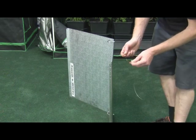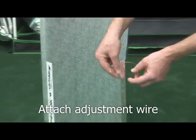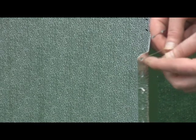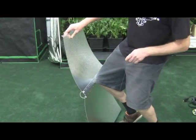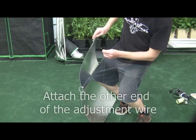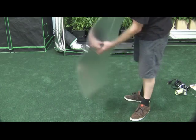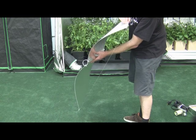To begin adjusting the wing, you put your adjustment wire in through the underside, and then back in through maybe the second hole, or one of the holes closer to the end of the wing, so that when you make your first adjustment it's not too narrow — you're not stressing the material. I find the best way is to put one edge on the carpet or the floor, put your knee in the center of the wing, bend it around gently, and attach the first wire. You'll see you've created a double parabolic shape by tension across the two ends of the reflector.